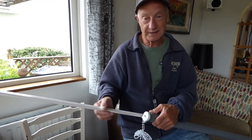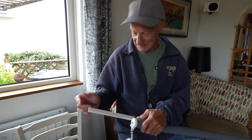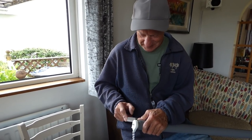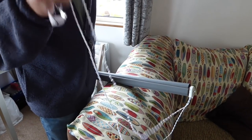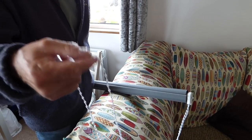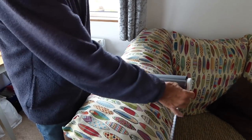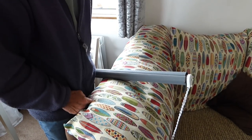Brackets are up on the wall. Don't forget the rod at the bottom to give it a bit of weight so it holds down - it's happened so many times where you fit it all up and haven't put the rod in. One very last thing: if you've got a joining clip in this blind, make sure it's positioned right up at the top so it pulls down and doesn't get locked up inside the winding mechanism.